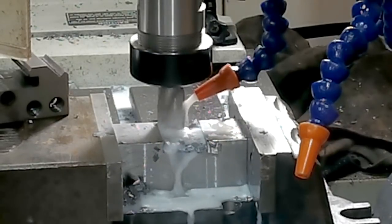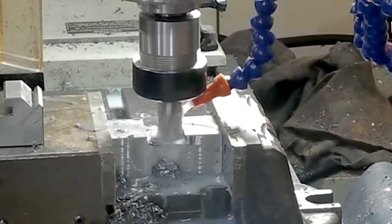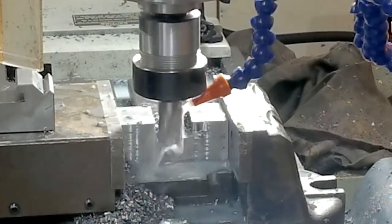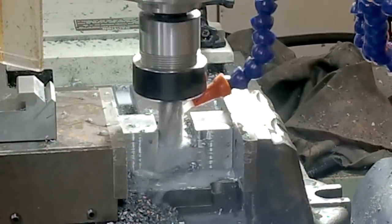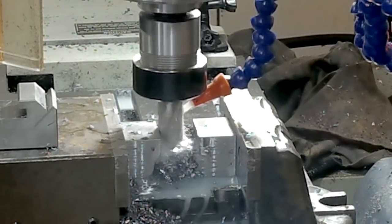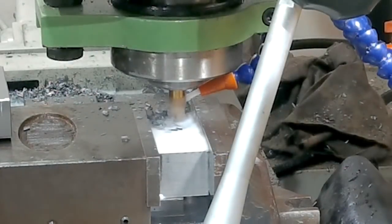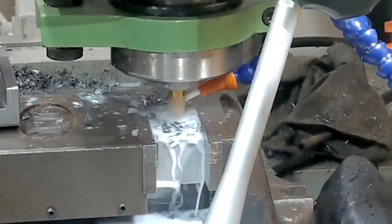I'm finishing the cut to 23.5mm wide and to the full depth of 11mm. The tolerances on this tool holder are for the most part open limit. The only critical dimensions are the two 90-degree grooves either side of the T-nut slot, which are in turn offset by 45 degrees to the rest of the holder. If those two grooves are ground too deep or the 6mm slots are too big, the tool holder becomes useless as the tool post can't grip it.